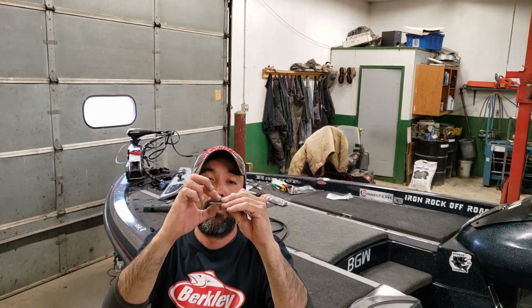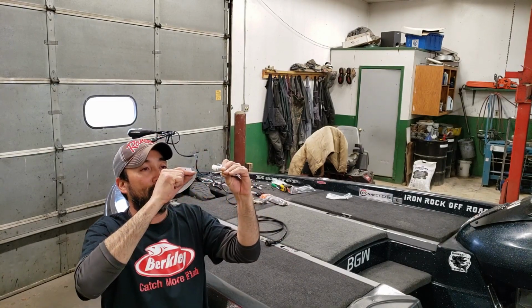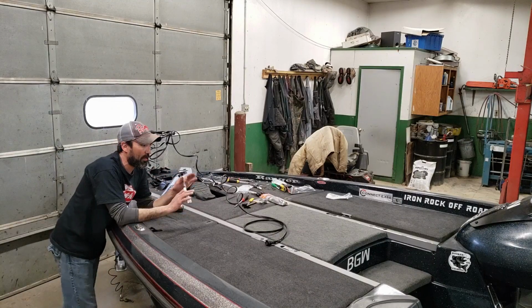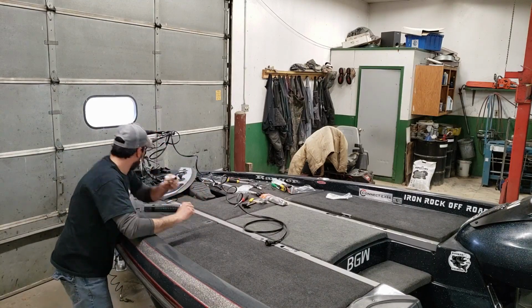And then leave the thread showing. So when you look at it, take that drill bit and put it in front of there and just make sure you can still see the threads on top. And then you're golden. But yeah, fill the holes in with Marine Tex if you have stripped holes on anything for your panels and stuff like this. This stuff's amazing. I re-tapped the holes.